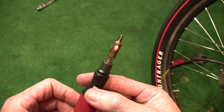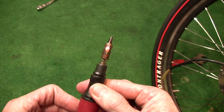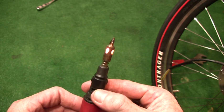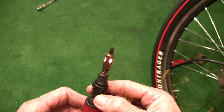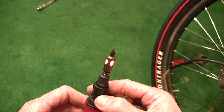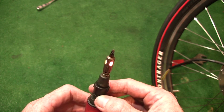You just refill it from a butane bottle. If you turn it back on again within a reasonable length of time, it's ready to go. It takes about a minute for the tip to reach full heat. And if you're doing heavy gauge wires, like two pairs of eight gauge twisted strand wires together, use full heat — you can't use too much heat when you solder.